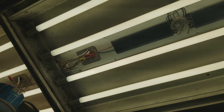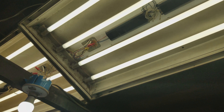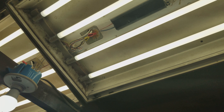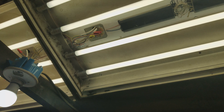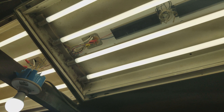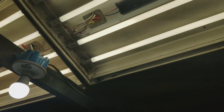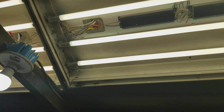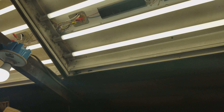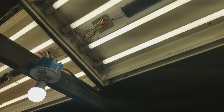Once you wire the side that's going to be hot — one of each color — put wire nuts on all that. I was also trying to test for a short each time I did one, just to make sure the tombstones on the ends weren't shunted. There are shunted tombstones and non-shunted tombstones. Mine weren't shunted. I hit the light switch just to see if the breaker tripped, to make sure before I threw the bulbs in — I didn't want to blow the new bulbs.